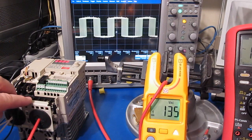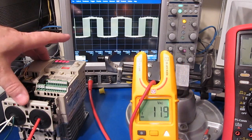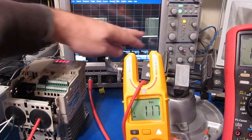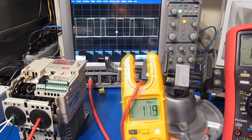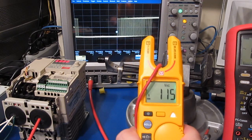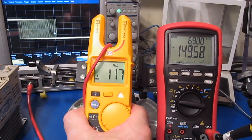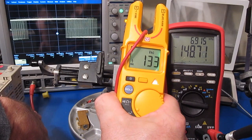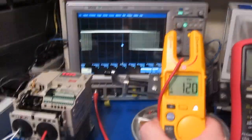So up to my left, this is a three-phase 220-volt VFD drive. Currently it's set for a fundamental frequency of 60 hertz and a carrier frequency of about 15 kilohertz. If we zoom in with the LeCroy, you can see the modulation. Currently I'm not grounded or anything — I'm just sitting in the chair. If I go ahead and touch the side of the controller, you can see it fairly closely matches what the Brymen's putting out. Again, this is me floating, and here I'm touching the side of the controller. I'm actually quite surprised that it can read this as well as it does.